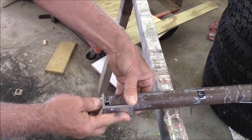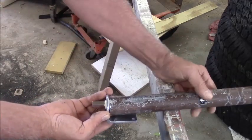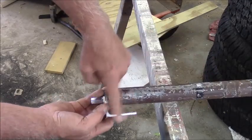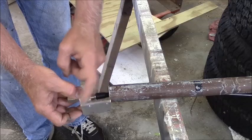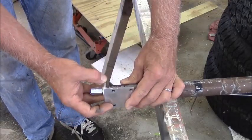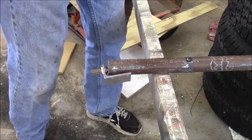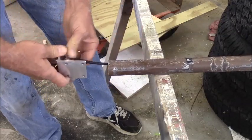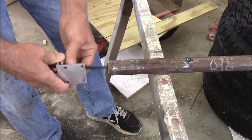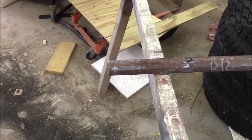I can see that would clear if I did it up high like that, but I'd really like to pump it out just a little bit and get it down tight. If you notice there's that little radius in there — this being aluminum it'll never corrode. Before I put this all together permanently, I'll tighten all this stuff up tighter than bejesus, because that's got to be my ground into the lower element. I've got to figure out how to drill and tap this. I'm going to drill this first and then center punch onto my pipe, drill quarter-inch tap holes, tap it, and put in quarter-inch stainless bolts. They're machine screws but I'll tighten them with my impact driver and get them real tight.